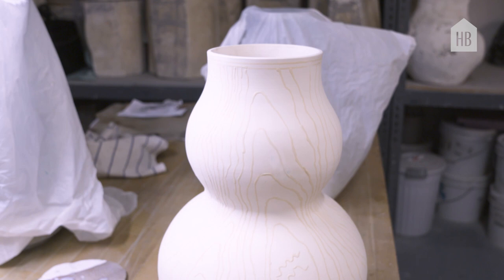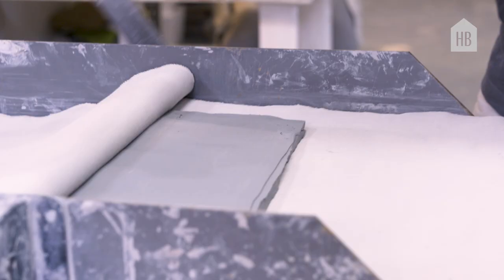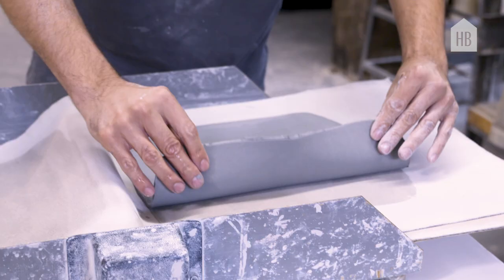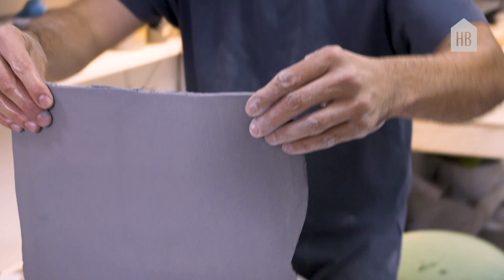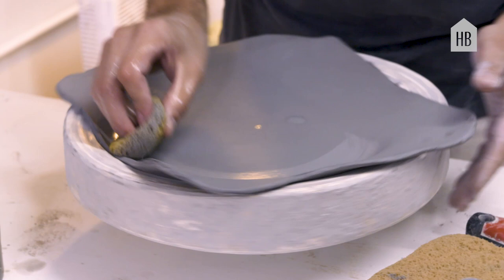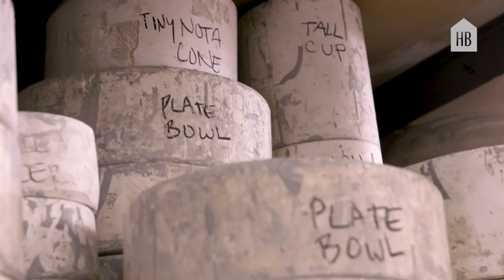And this actually is how it is going to end up. So what I am cutting out are slabs of clay. I'm going to throw this in the slab roller — this is a small tabletop slab roller. We're going to take this clay and drape it into our plate moulds. This is called the slump technique, where we're slumping the clay into the moulds, so the moulds allow us to have some consistency when it comes to production.